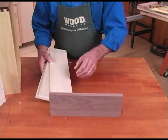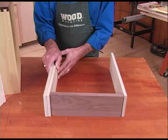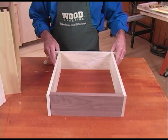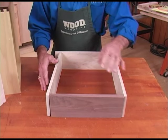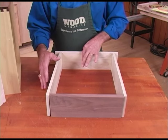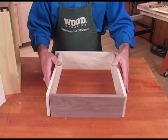Let's start with a piece of three-quarter-inch walnut — we're going to use that for the front — and then I've got half-inch pieces of poplar for the sides. On your standard drawer, the front is where all the stress is placed, and that's where the dovetails go. On the back, we're just going to have a standard rabbeted joint, so you won't see much of that, but you will see the full sides.